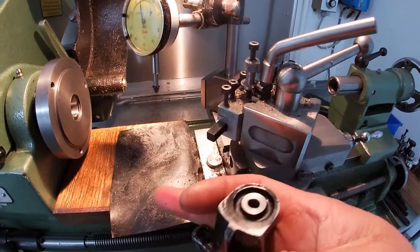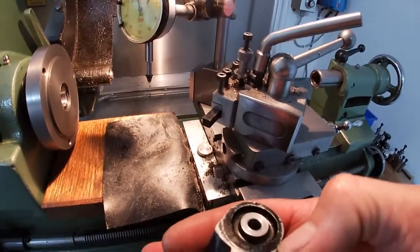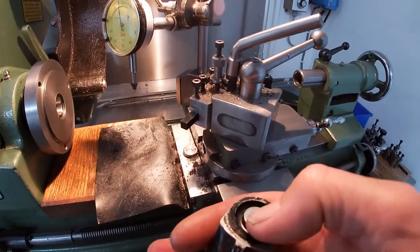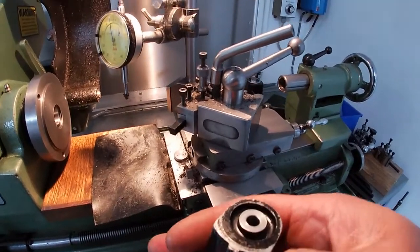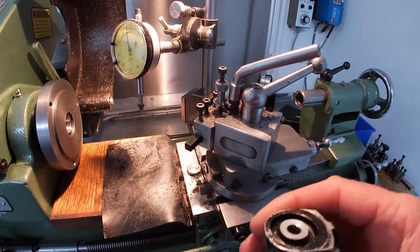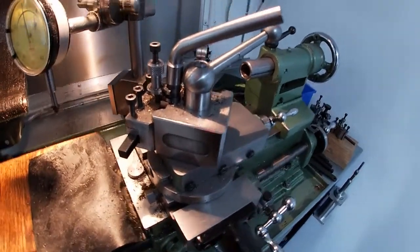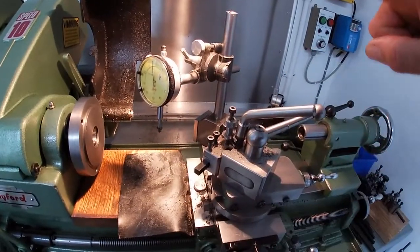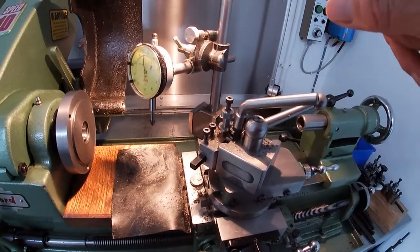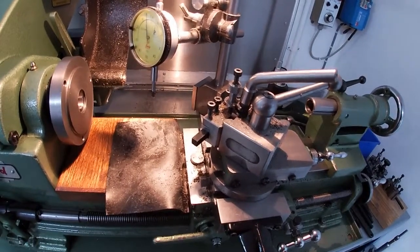And if you look at this one as well, you can see that it is actually dished. Now I've experimented with brass washers, phosphor bronze washers, and Tufnol as a fibre washer in here, and there's always been backlash. You always adjust it up and the problem with it is when you go to tighten up on two metal surfaces, you're going through a very steep curve — going from being slack with a bit of play to very very tight. And one of the things I didn't like was the friction feel of that.